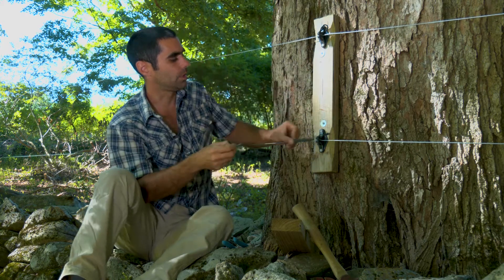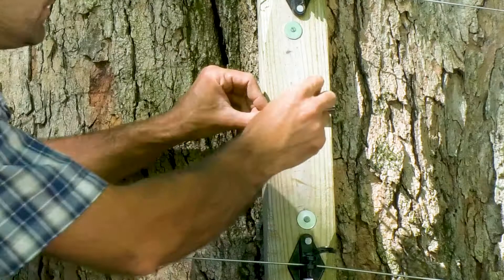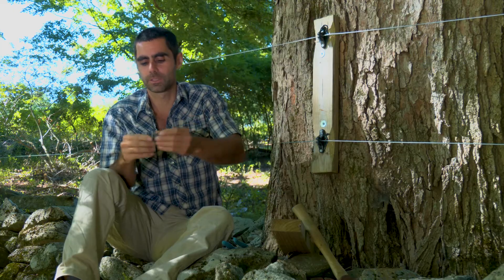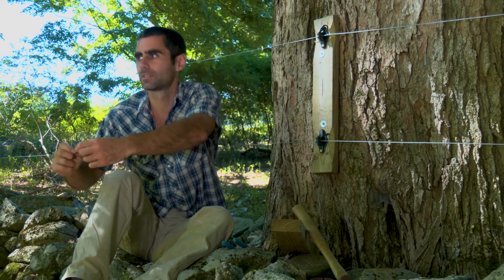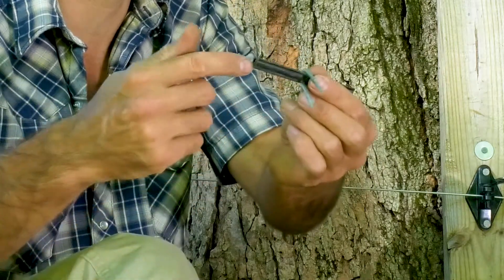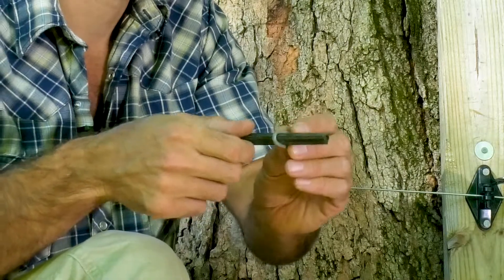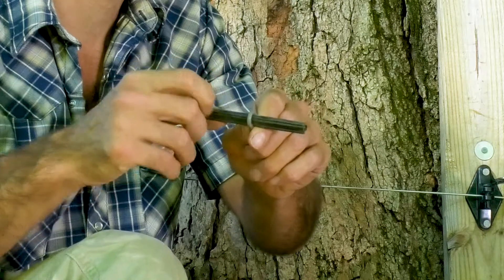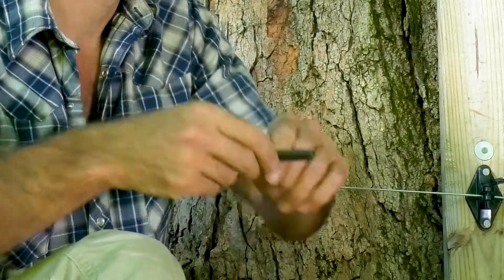These would go in — you slide them all down your line at the start and then staple them in. You don't crush them completely because you want them to still be insulating, but you staple until the top fin gets compressed. You want the fence to still be able to slide in the tubular insulators, making sure you're not creating a pinch point. If you hit them too far, you'll break the insulator and it will short electricity between the wire and the staple.